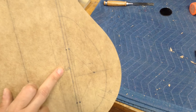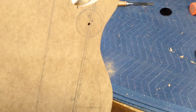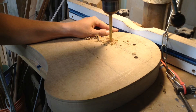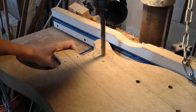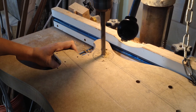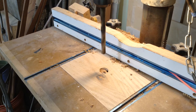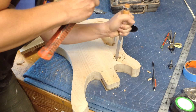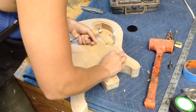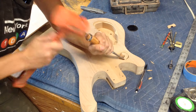All the holes on the bottom are three-eighths of an inch and the hole on the top is a half inch. The reason I didn't drill the half inch from the beginning is that it would have been too big to use the pilot hole on the hole saw. I went through with the three-eighths bit for those three holes and then a half inch for the top potentiometer hole, drilling all the way through to the back because that plug has to come out. You could keep drilling holes in the back to remove material, but with a plug like this, if you just use a chisel after a couple of mallet blows, big chunks will start breaking off, and you can chisel out that plug until you reach the bottom.